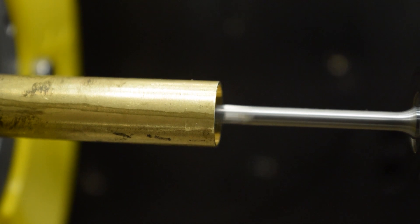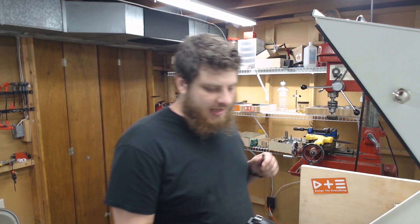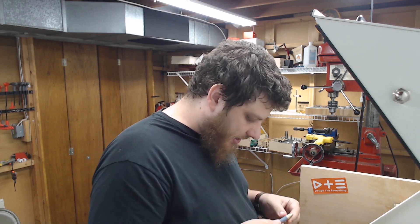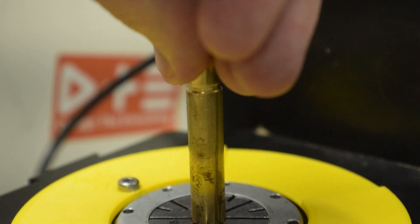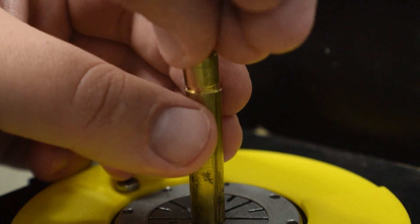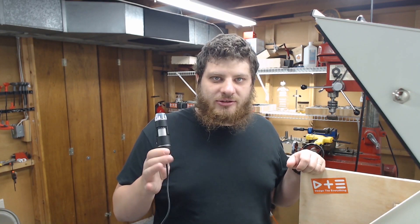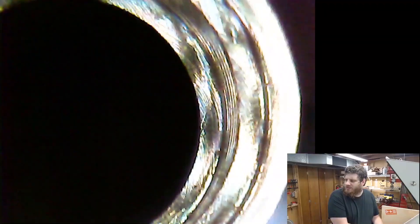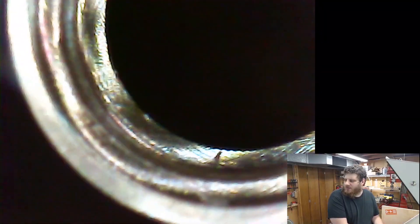OD thread milling is much more exciting. That was easy and those look like threads. Let's take my prototype apart and see if it works — will it thread? No. Looking down in there I don't see a start of a thread, which I think means my first bore wasn't deep enough or my thread mill didn't come far enough up. Let's get a look down in there with the microscope and see if we can see where the thread starts.